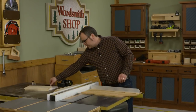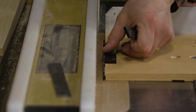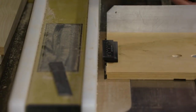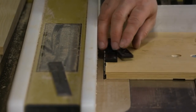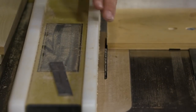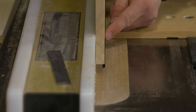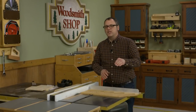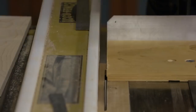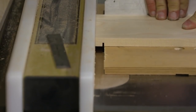I have an eighth-inch wide blade set up in the saw and I'm going to use the sled to guide my parts. I want the depth of cut to be a quarter of an inch, so I have setup blocks, and I can put another one over the top and eyeball and feel when the blade touches the underside of the cap setup block. For the fence setting, which I'm using as an end stop, I have that matching the thickness of my end pieces so the outside edge of the tooth is flush with the end piece against the rip fence. Rather than going by measurements, I'm going from the real-life parts. Now I can bring the part up, set it right over the top, right up against the rip fence, and make a dado on each end of both of these pieces.